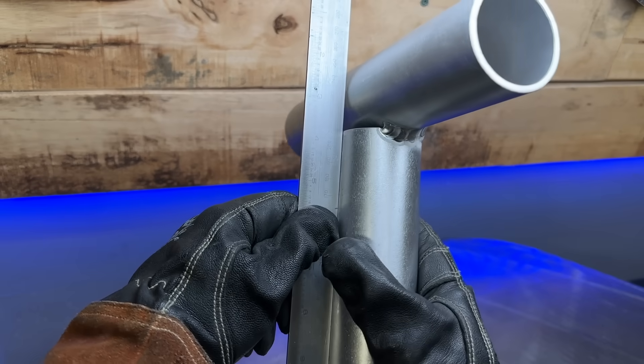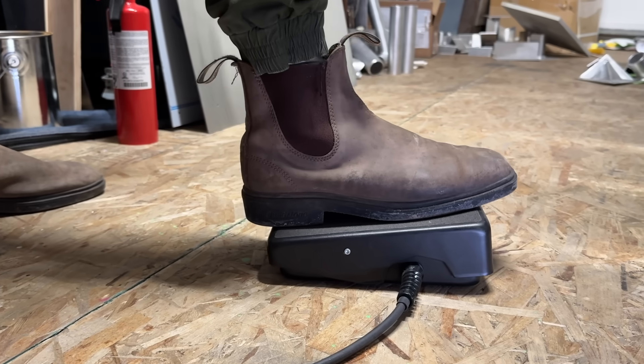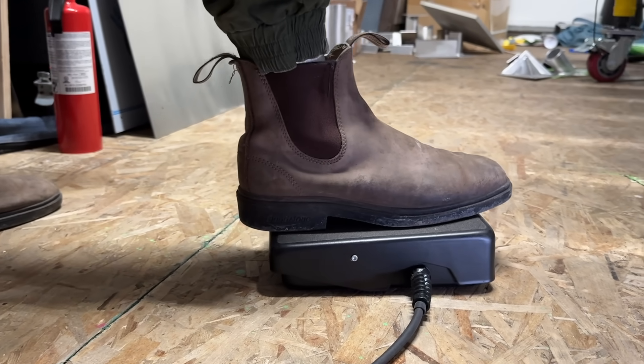Flipping it over — next side, same deal. I'm going to butter up this edge exactly like I did with the first side. You can see I'm jazzing it with a good amount of heat on the pedal. I'm making sure that the filler material sticks to the pipe in a way that it butters up the edge so the pipe's profile doesn't become hollow or concave. Using adequate filler is the really important detail here. Without adequate heat as well, we could potentially have inadequate fusion in the welding — and obviously this is a massive flaw if it occurs.